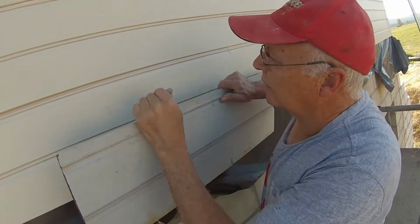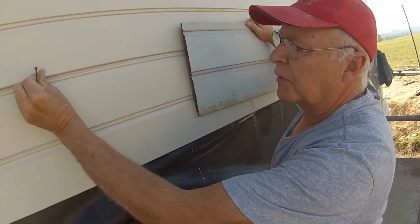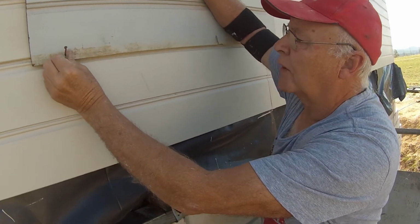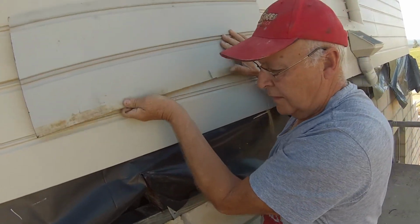To be able to handle the 3.5 metre long WeatherTex boards on my own, when I was fitting these boards, I'd put a 4-inch nail in a wall stud at one end of the plank. That enabled me to rest the plank on there, fix the other end, come back, take the nail out and drop the other end down.